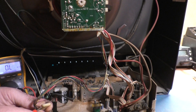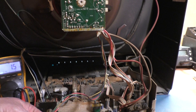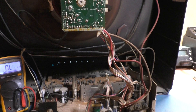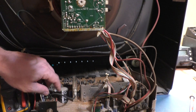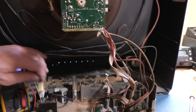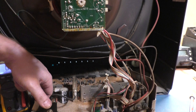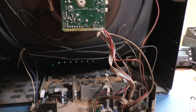This is where our test will tell us whether we can use this yoke. We're looking for around 2 ohms for horizontal and we have 1.5. Technically that will work but I don't like it being 1.5 — if it were closer to 1.8 I'd be happier. We'll go ahead and still try it; we'll monitor the HOT and the frame to make sure it doesn't get too hot. Assuming it doesn't, we're probably going to be alright. Those readings are within range but not quite ideal, and it won't stop us from testing.